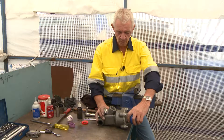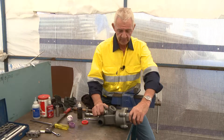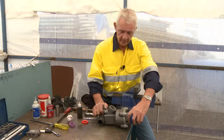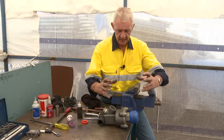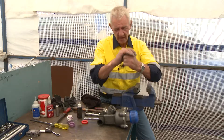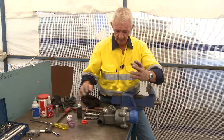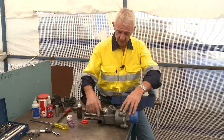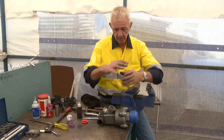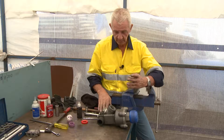One is that moisture will cause premature wear to these particular units. The other is a terminology called differentiation of pressure. Differentiation of pressure occurs at the pressurized blast pot, which has air over the top of it from the standpipe and the pop-up valve inside it. If the pop-up valve doesn't seal properly, you have air escaping from the top of the pot. The pusher line air that comes down to the Thompson valve is then different to what's been pushed into the pot — so the pop-up valve is not sealing.